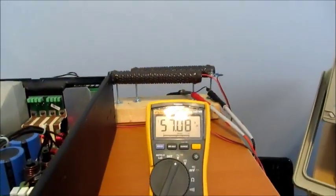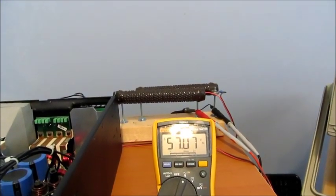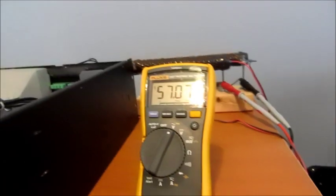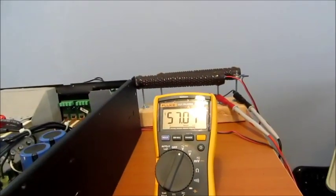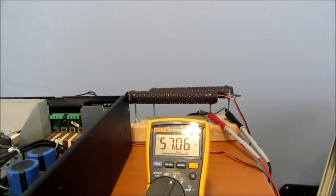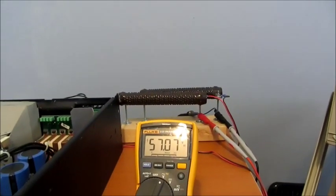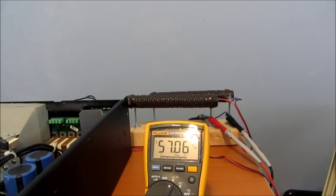and I have my computer turned up as loud as it goes, so I think the input sensitivity of this isn't very high, so as a result I'm not able to rail it out and activate the clipping light. But basically what's happening here is I'm just driving a resistive load, and there is a lot of heat on those resistors. If you ever do something like this, do not touch those resistors, and it's usually a good idea to keep a fan next to it too.